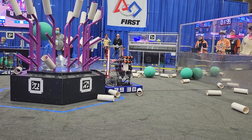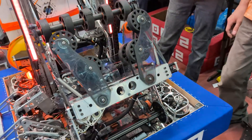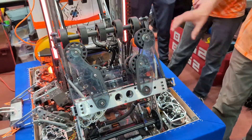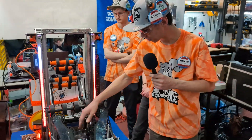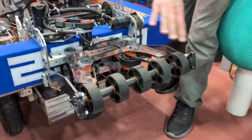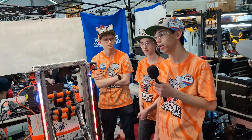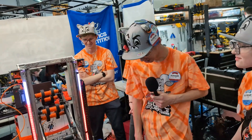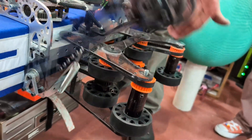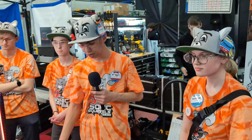The intake was originally inspired by Big Sky Robotics' Robot in Three Days and an intake designed by one of our alumni — a V-shape with pieces going in. Later we modified it to have a top roller, which significantly improved our intake ability and allows us to hand off so we can score L4 really fast. Our L3s are almost sub-second now. For the intake, the pivot is mounted lower than the top so that if we run into a wall, it just springs up. The entire thing is super compliant with springs, so we've had no problems with it breaking.